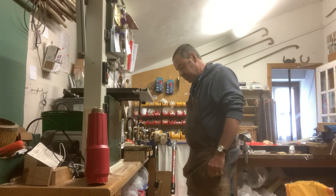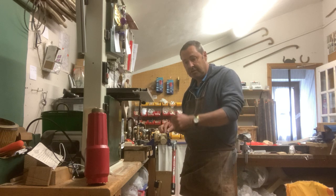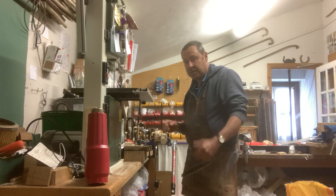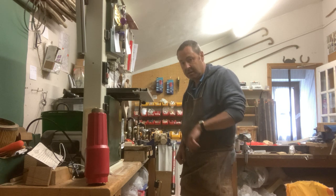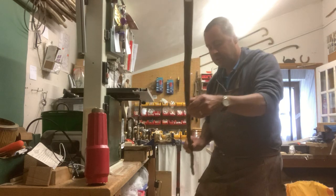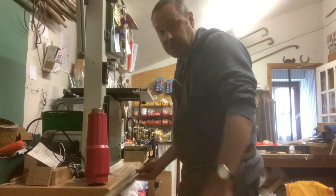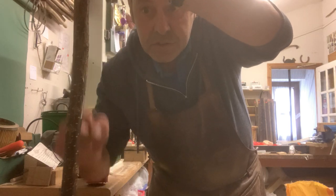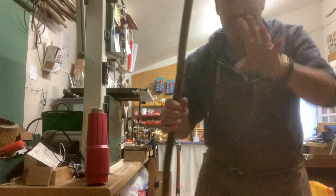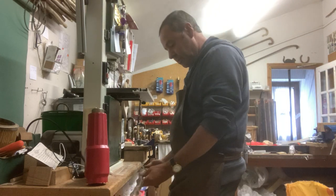I've pressed it right out. How long do I leave it in there? Roughly the same time as I've heated it — so 10 to 15 seconds. Don't leave it too long, otherwise it will bend that way. Take it out and check it on your straight edge. You can't see, but that bent bit is now straight. Here's where the bend was — that bit's straight now. It's got little bends in it but I'll take those out later. Basically that bend is gone.